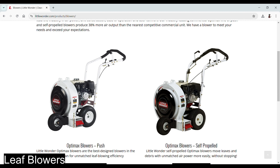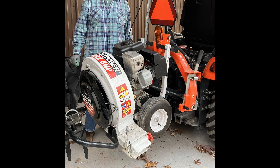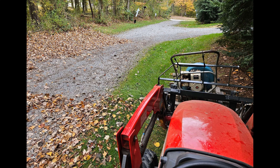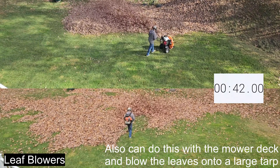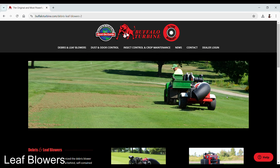If you don't want to pay for the DR vacuum, there's the DIY leaf collection shown in one of my past videos. It doesn't have a secondary mulcher, but with a little cart, some tarp, and spare wood, it's a pretty good way to collect leaves without spending much. There's also the John Deere Power Flow, which has a booster that hooks into the belts from your deck to help with leaf collection. One big problem with tube-based collection is clogging, so a lot of people do a first lap to mulch things up fine, then a second lap for actual collection.